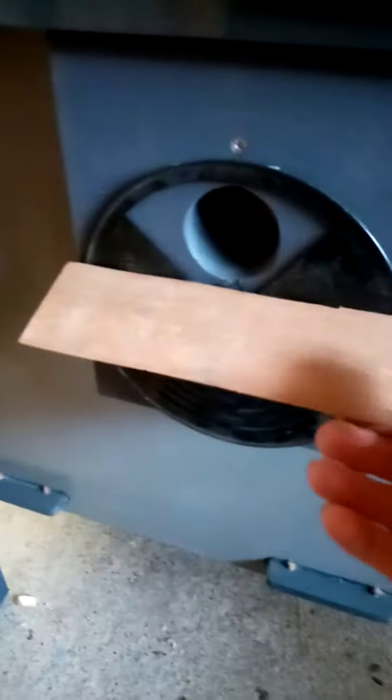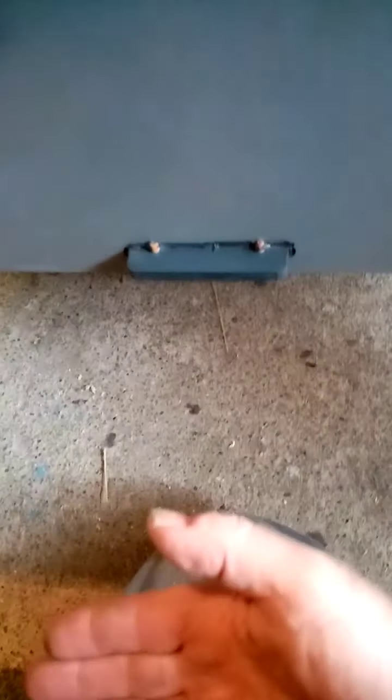Around the front we've got the entrance. I build it so that the 50mm insulation slides behind — you slide it up from the bottom. Cut the slot three inches wide and about eight inches deep, and then the polystyrene just slides up and locates behind here.